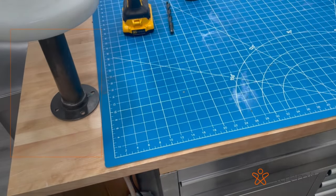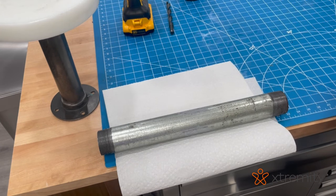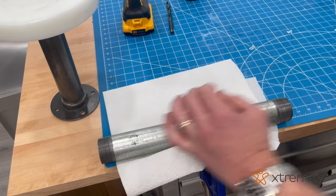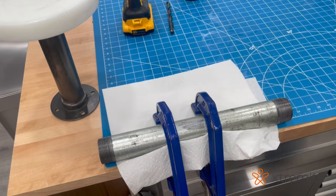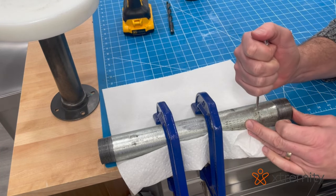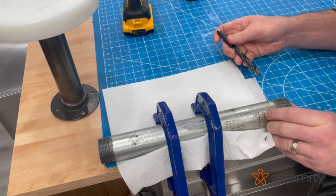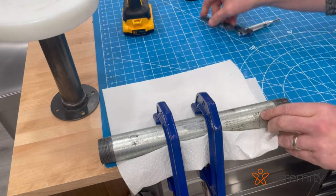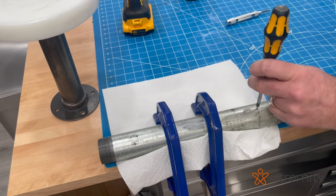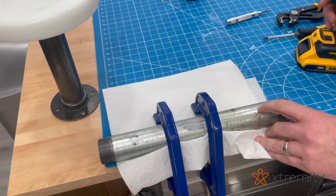The first thing I'm going to do is drill a hole in the pipe for the vacuum barb. To do this, I take my section of pipe and clamp it to the table. I want to punch a starter position for my drill — this is called an automatic punch. Another way is to grab a sharp point; you're just trying to get a little starting area for the drill bit, so a screwdriver or anything sharp will work.